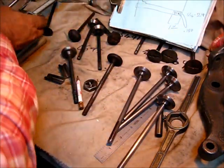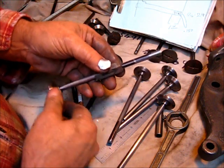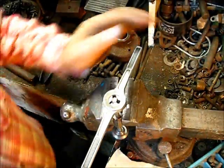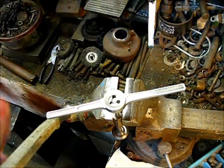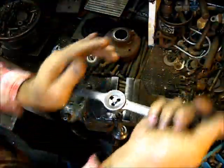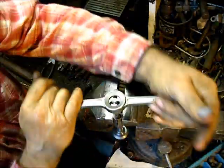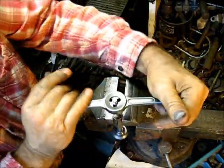Cut that off and thread it — it's just threading and cutting. Get it up there close, saw that off, and thread it. Put your thread cutting oil on there, get that die stock out, tighten up your dies using the jaw part we made, and just go gently and thread this to a one-inch length.